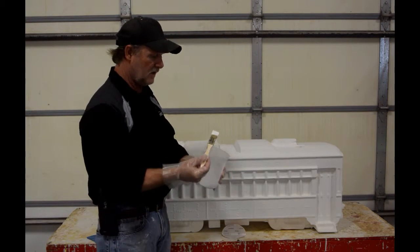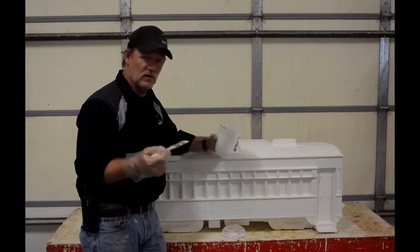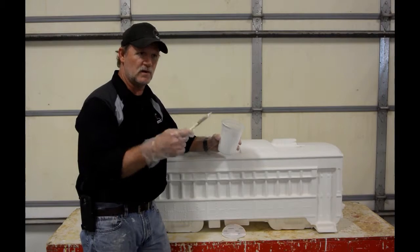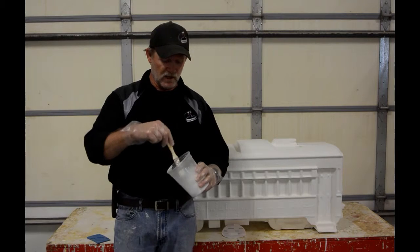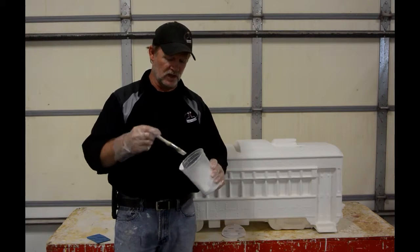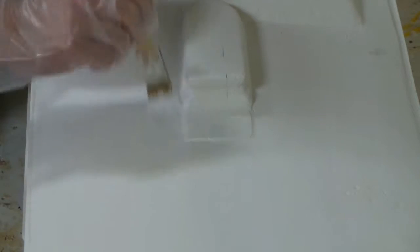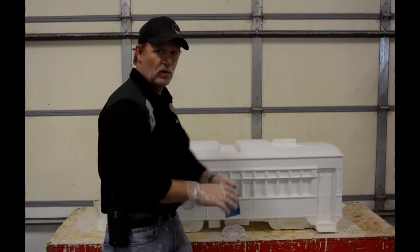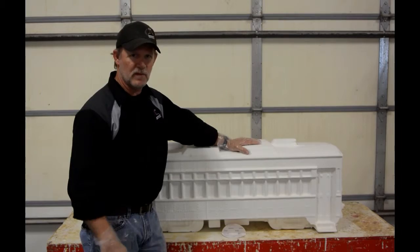Just take the primer after you're done. This is a Sherwin-Williams bonding primer. You can use different types of primers — Diamond Vogel has one, it's a plastic adhesion promoting primer. Gesso works fine. Use whatever is going to work with the paint that you're going to put on. All you have to do is re-prime that spot, then go through and re-prime any other spots where your primer is flaking and you sanded it back.